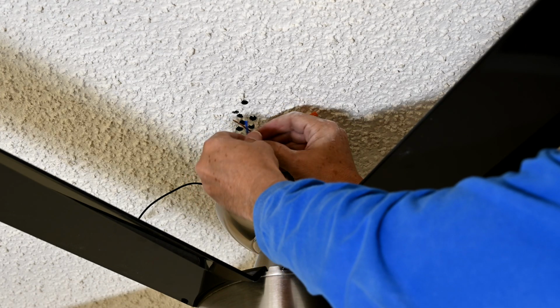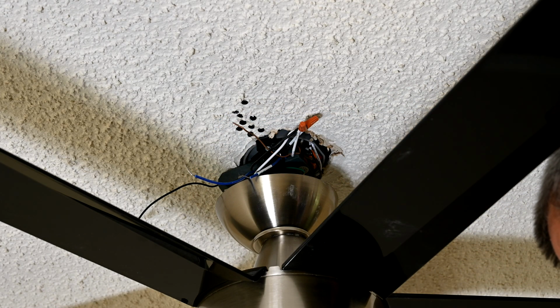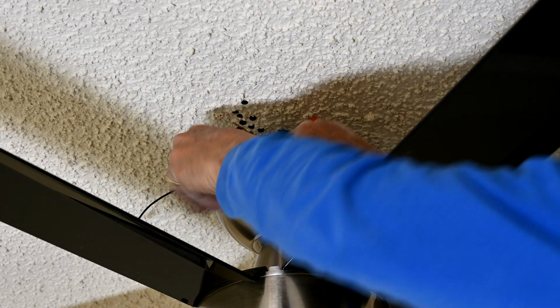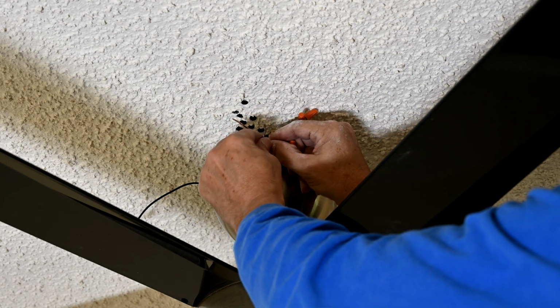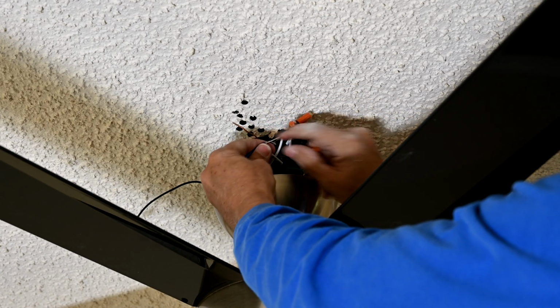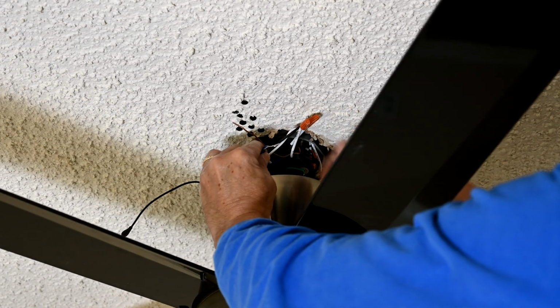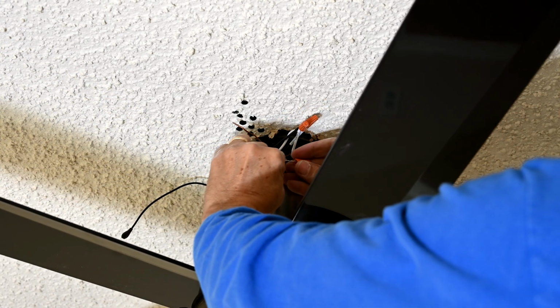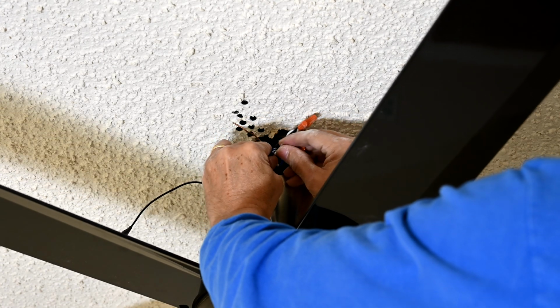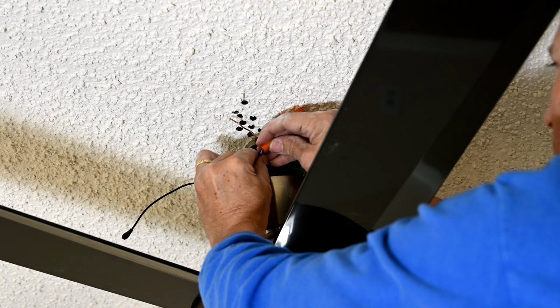This is the one that controls the light and how bright the light is, depending on the voltage that is applied onto this wire for the ceiling fan by the transmitter based on your command through the remote for the ceiling fan. So this, I'm going to bend it back a little to thicken it up some, see, like that. We'll put the wiring nut on there.